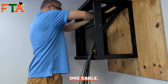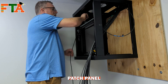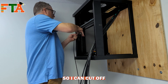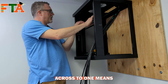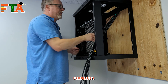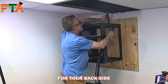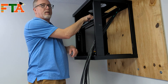The first thing I'm going to do is take my number one cable, lay it out, and estimate the length. I'll pull it through the patch panel and use it as a template to shorten up all my other cables. When deciding where to cut, I want to make sure I've got my 90-degree turns and enough length to strip down for my keystone. Bringing this cable from the far side all the way across to port one means it's my longest cable — a perfect template. Before you cut, make sure you've got your service loop in the ceiling and calculate your distance.